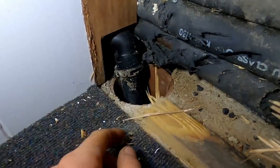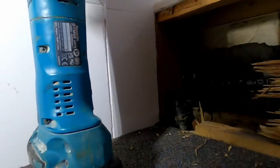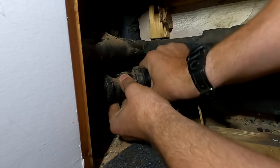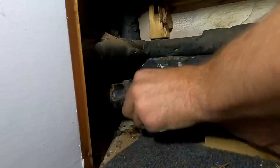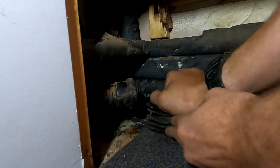Right, what I might be able to do — it's coming at a funny angle. I'll take this bit off and see if we can sort that angle out and get it more in the middle. The only good thing with push-fit — oh look at the state of that. You'd call it a chamfer; that should just push in. Sometimes you need a little bit of grease on these, but most of the time they'll just push in. The heating pipes are in the way a little bit.